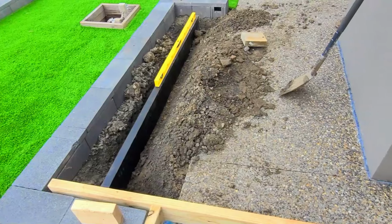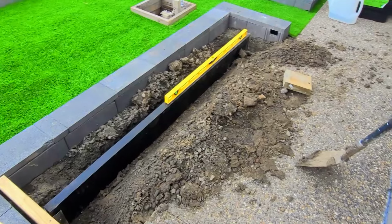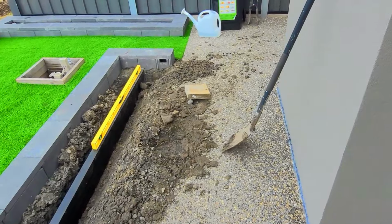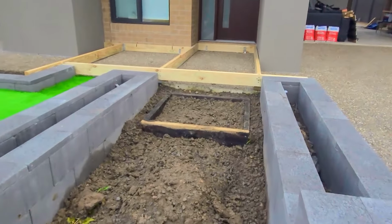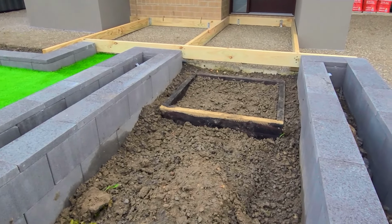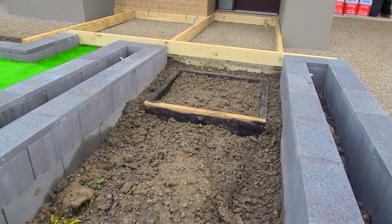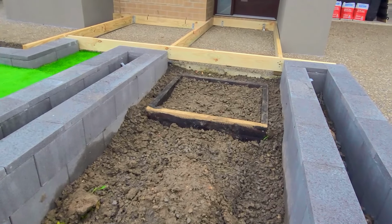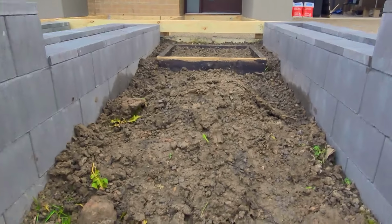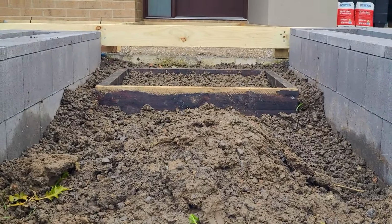So I'm just going to put the soil back in and make it finish, and then I will start to either continue from here or maybe I'll extend the frame till that border. This is the second task for today. Actually I'm planning to have 3 steps. So instead of installing the post, I did use H4 sleeper, make a square box, level it, and then I just use it as a foundation for my deck step, which look perfect.